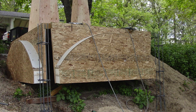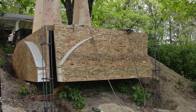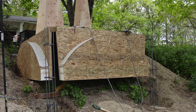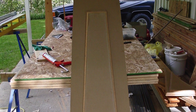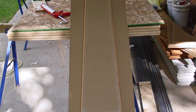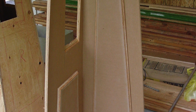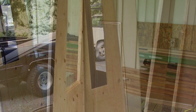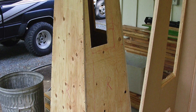The order of operations is important in a build like this. You can see the rebar is tied up before I installed the corner posts — I wouldn't be able to get to them otherwise. So there was a lot of forethought and planning about which piece went on first and last. I used form-grade plywood on this project; it has paper on it that is designed to release from the concrete easily. You also add a release agent, and it helps a little bit.